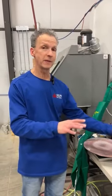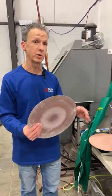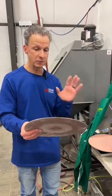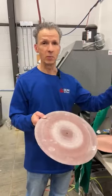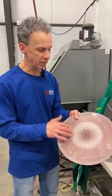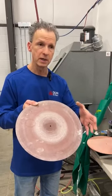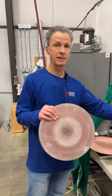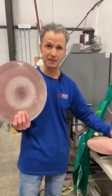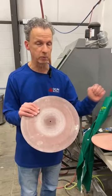What's really nice about this Maritool grinder is that we can polish with it, taking your piece right to a polish by going through a series of different discs — 100, 270, then the 325. That one sounds close to the 270, but it's a resin disc, meaning the diamond coating is in a resin coating. Because of that, it's actually more like a 600-grit plated diamond equivalent. So even though it says 325, it's really quite fine and gentle.